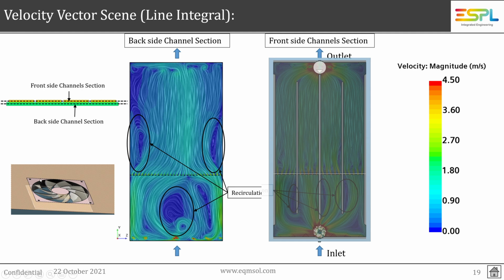And here you can see the angle at which the air is now diverted from the fan is maybe 20-25 degrees. In normal mode, when the fan is rotating, it pushes the air straight up, so it's not exactly like it is at the moment. When it comes to the exit side, I think I need to make, on the visible side, the triangles so that they pull a little bit more air towards the side, so the corner triangles should be a little bit bigger. Then the air will more willingly go to the corner holes, because it has an easier route there. So that will help with this one, and the extra flow which is here in the visible channel will also make it go more towards the end straight line, which is better. So that's what I will change for the next simulation.